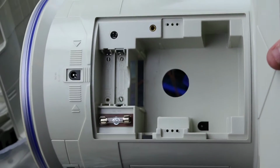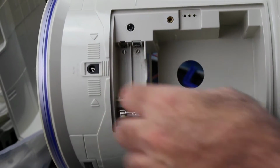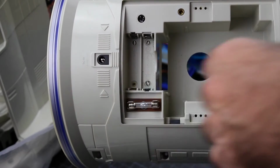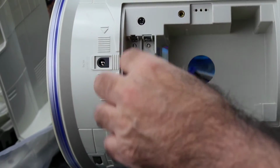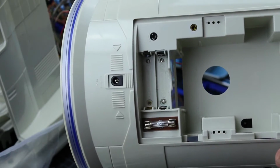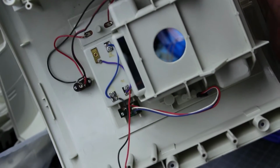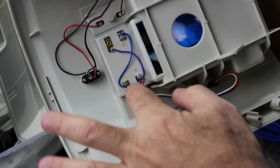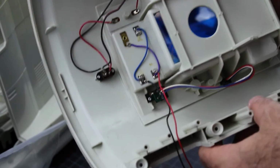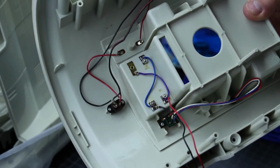Basically, as I pointed out earlier, I drilled a hole in them underneath. So I put 2.5 millimeter screws that are really flat, so the AA batteries will rest just barely on top of them, because there's just a tiny bit of a lip here for them to sit in, so that works out really well. On the back side, they're held in by a nut for each one of those little tiny bolts that goes through. And I soldered the crisscross wires and the positive and negative that goes to the cassette board.